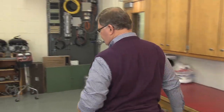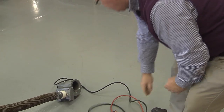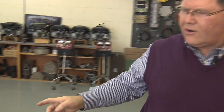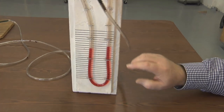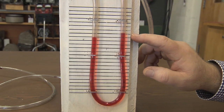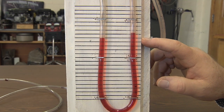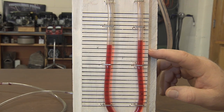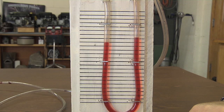Now I'm going to plug the fan in and start the airflow. We can hear the fan running and we've got air going through the bin. What we're measuring is the resistance to airflow through that perforated floor — the amount of static pressure developing under the floor to move the air up through it. Looking at the U-tube manometer, there is one marked difference between the two water levels, indicating that the static pressure through that floor is a quarter of an inch.